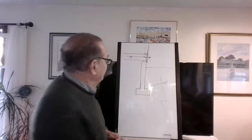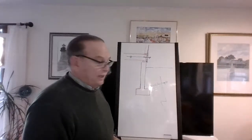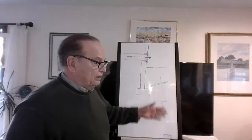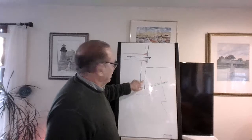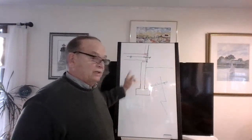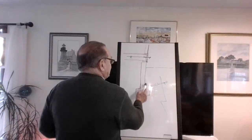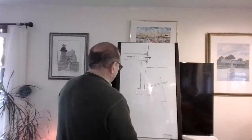Okay, you think you're going to start drilling here, putting faucets? You can try it, though what's going to happen is your fancy $30 drill, that nice long twist drill, you're going to drive it right into the concrete. So before you drill anything, check out what's on the other side. Always check on what's on the other side. Okay, that's a little unusual, but I've seen it several times. Get back to this one.